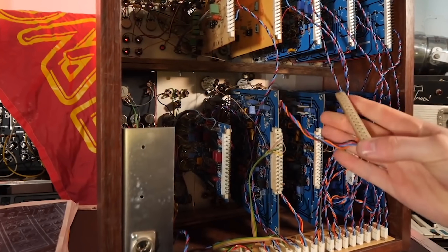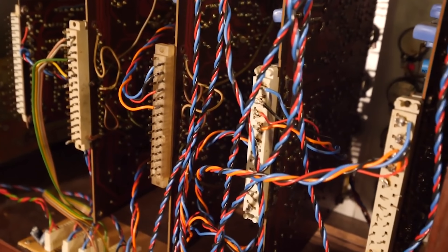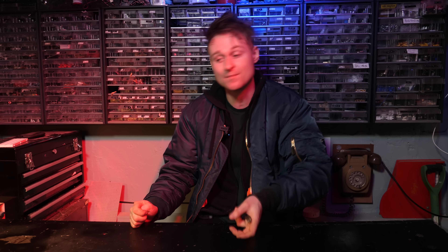The other Formant was not set up as described in the magazines. The Formant isn't actually a modular synthesizer — it's a semi-modular synthesizer, intended to be set up like a Korg MS-10 or Korg MS-20. The idea is that there is a default setup: no patches in any of those jack holes, and you play the synthesizer and it makes noise, because there is a default routing — oscillators get mixed together, go into the filters, then into the voltage-controlled amplifier, and so on.